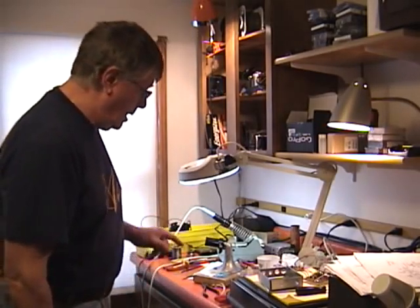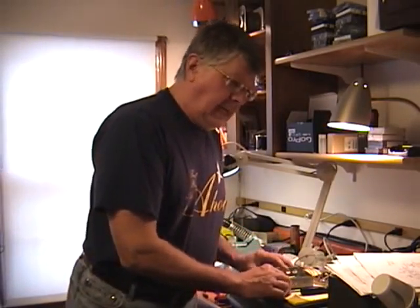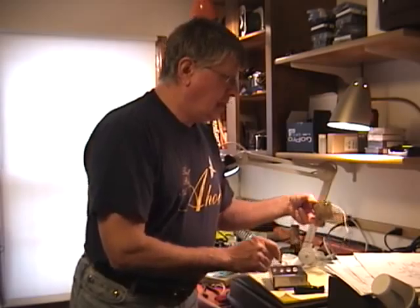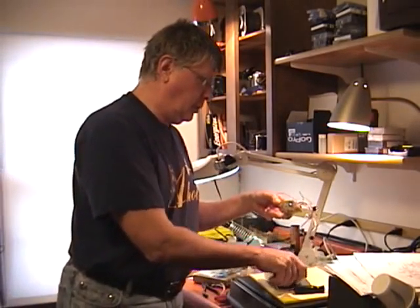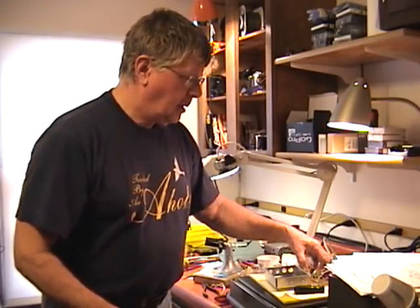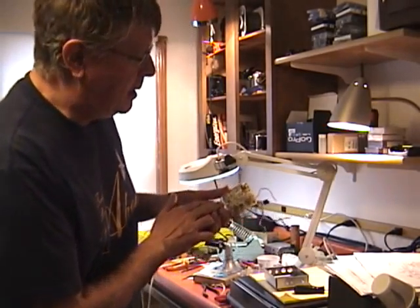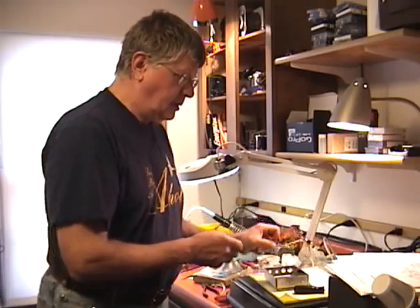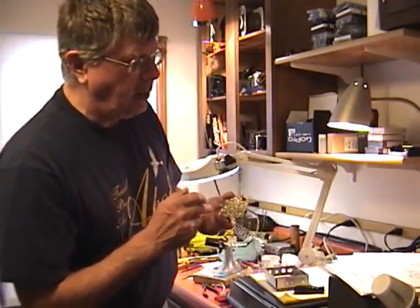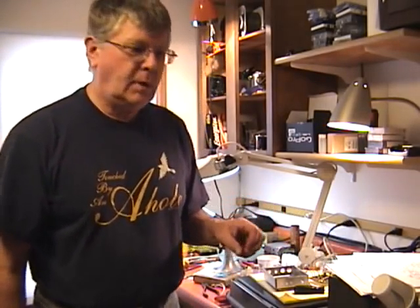A little Panavise is handy for holding your circuit board, along with the magnifying light. I'm using standoffs, and it's recommended that you bond all the grounds to the chassis of the enclosure. I used 4-40 machine screws he enclosed and 6-32s with nuts drilled out as spacers, with washers to stand them off the bottom so they don't short out. That gives you good grounding and bonding for the grounds, which helps eliminate frequency instability and chirps according to others who have assembled this kit.